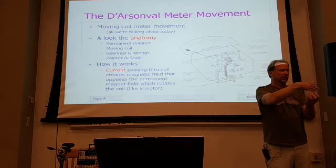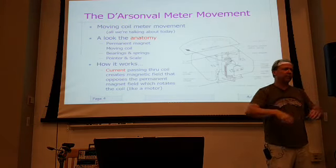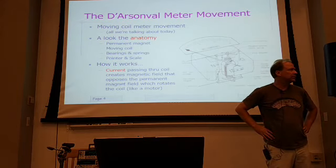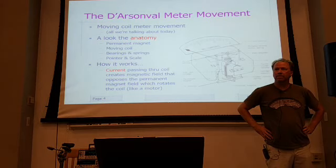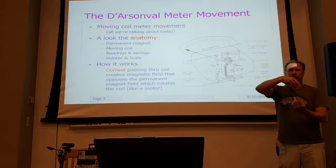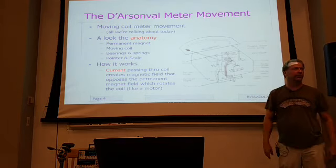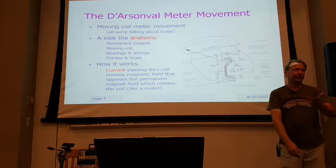I wonder if that has a bit more mechanical dampening than these little coil spiral springs. I've seen them in better meters. Supposedly they don't have the stick-slip problem. One of the things that kills these meters is the bearing there, that's what causes the stick. So the taut band is the suspension and the resistance, that's their spring. It's separate from the stick-slip.